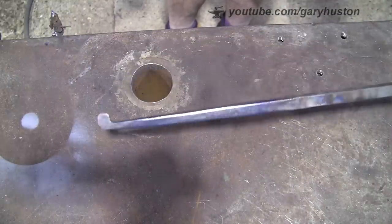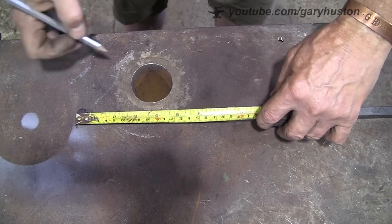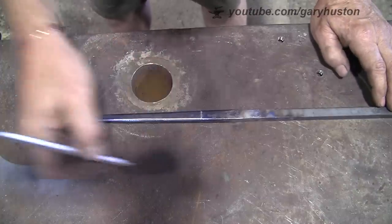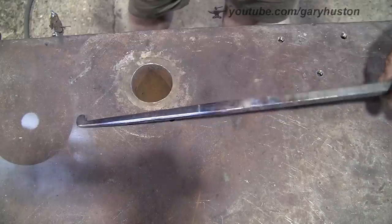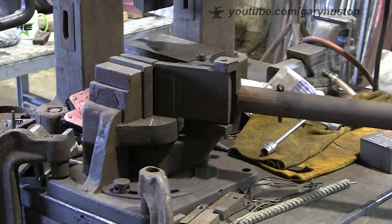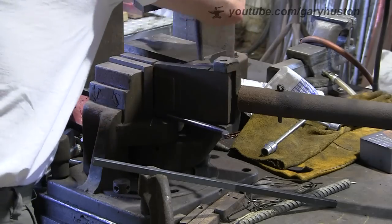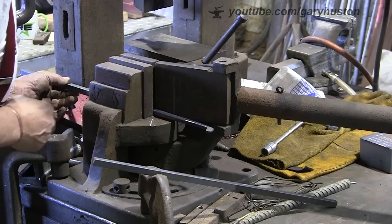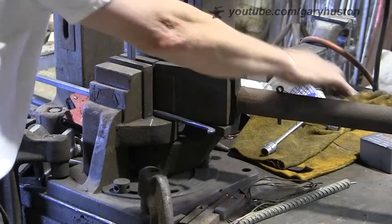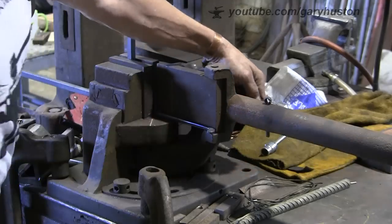There you go, you can see it's come up quite nice. I'm just going to mark it out now for where I want to bend it - and again, all hit and miss, I'm just winging it. I'm going to go for about six inches for my first bend, and then we'll work out where the second bend comes once I've done that one. I could do this over the edge of the anvil with a nice hot heat, but I'm going to use the miracle bender - just because I can, I've got it, it's easy, it's done in a second, and you can be fairly precise and you don't get any hammer blows on it.